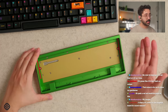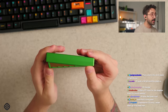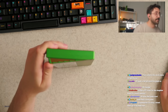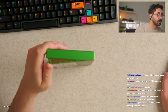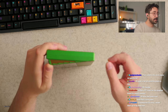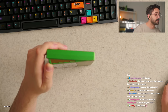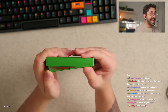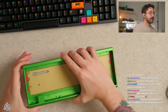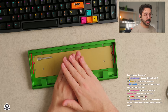I don't know what this sounds like or what this is gonna feel like, but this has a cherry lip on it. That kind of brings down the front height — the effective front height to the stem is like 21mm, which is great. Then the front height to the non-cherry-lip part is 16.48mm, and with the cherry lip it's a little bit lower. That is a crazy comfortable front height for me. I've been really appreciating designs that take low front height into consideration.